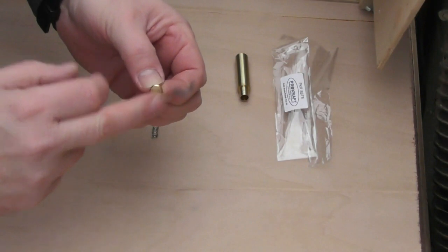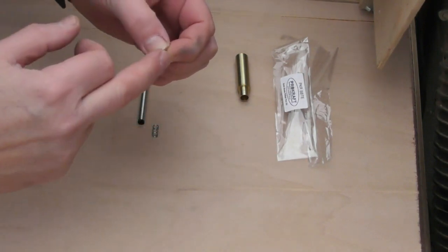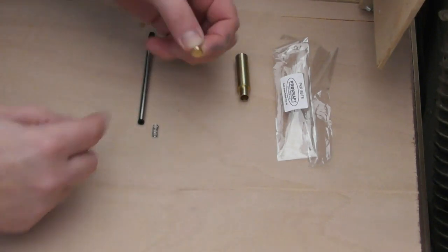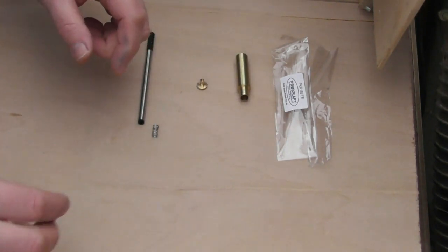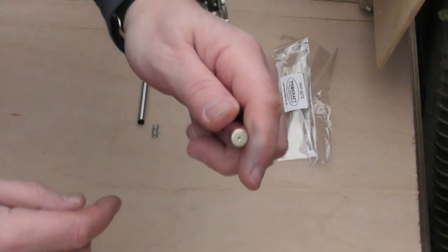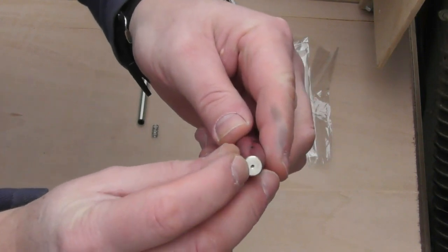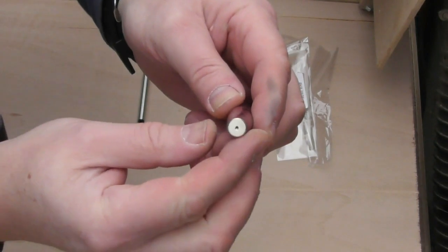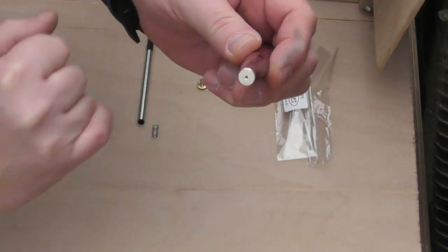Now the brass end you'll see is flat. If you want to turn a pen with this in and finish this on the pen you can do that. Brass is fairly soft and as long as you have a steel live tailstock you can do what you'll see I've done here. It's the tailstock that's just made that little point — it does have to be smack bang in the middle. It just leaves a little pin mark in the end there.